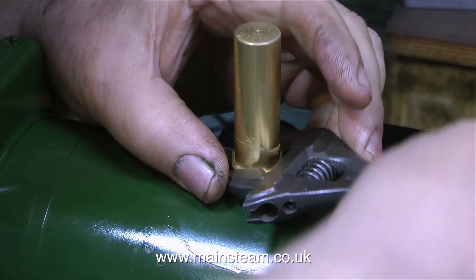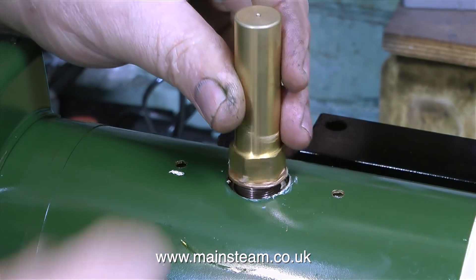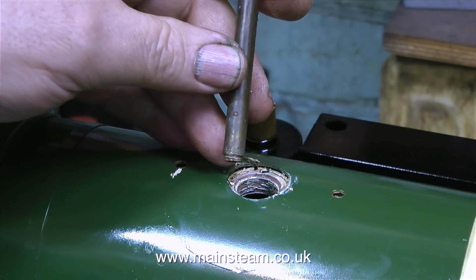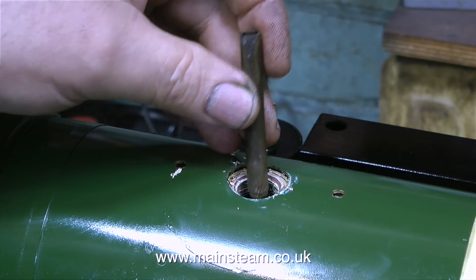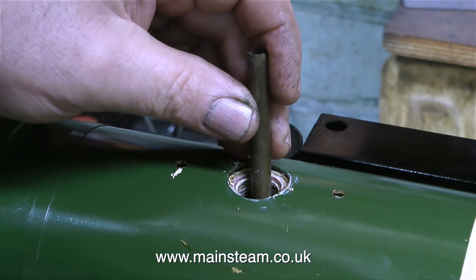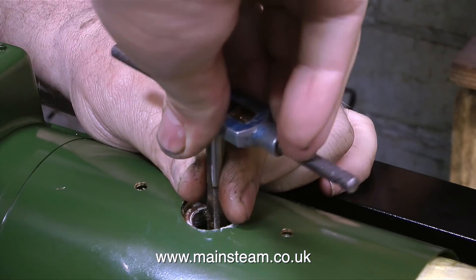What I'm doing here is taking off the inner part of the dome to have a look inside it. At least there is a collector pipe in the dome, but it's not attached to anything. It has about 1.5 threads on it, and these 1.5 threads are what holds this pipe in place on the main regulator tube — obviously not well enough. It beggars belief how such a quality piece of engineering can be put together so badly, when most of the parts are very well made indeed.